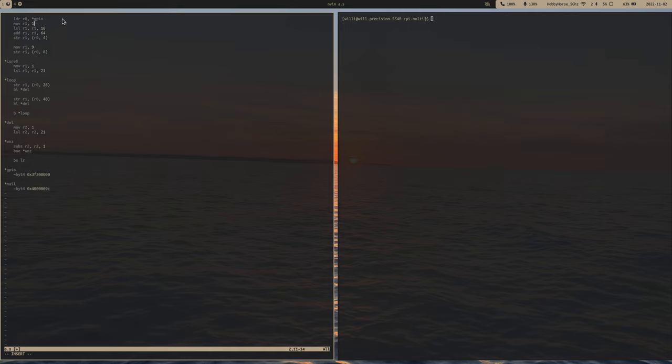Let's clean this up a bit, and then we'll need to reload our GPIO when we jump to the other cores. So let's just load that back into register 0. And then after that, we'll just branch to the loop. And I like my spacing. So that now we can, let's copy this. I know, mouse on NeoVim cringe.